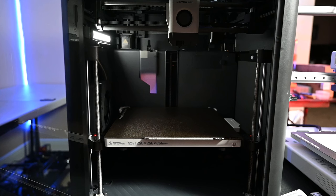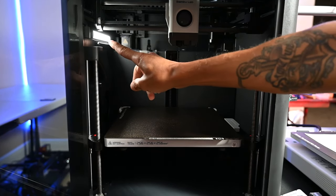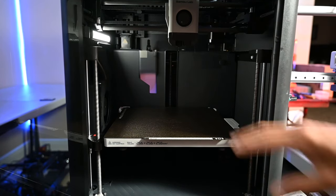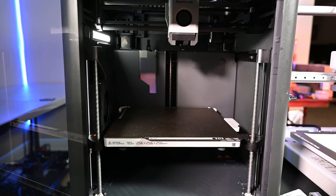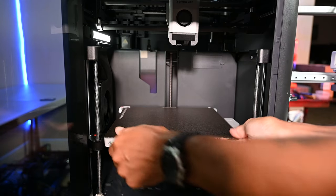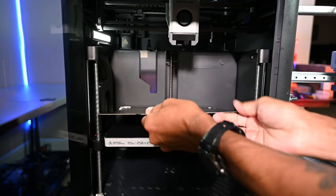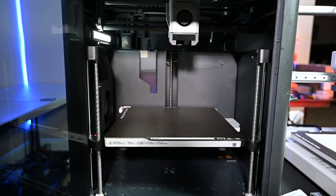For ease of use on the P1S, since it's enclosed, it's a lot darker inside. There's one light bar on the left-hand side. Installing the build plate can be trickier in the dark — I actually printed a guide in the back to help line it up. Nozzle changes on this printer are more tricky. The cover is magnetically held in place, but there's a fan with a cord attached, and I believe you actually unscrew the nozzles and there are wires to unclip.